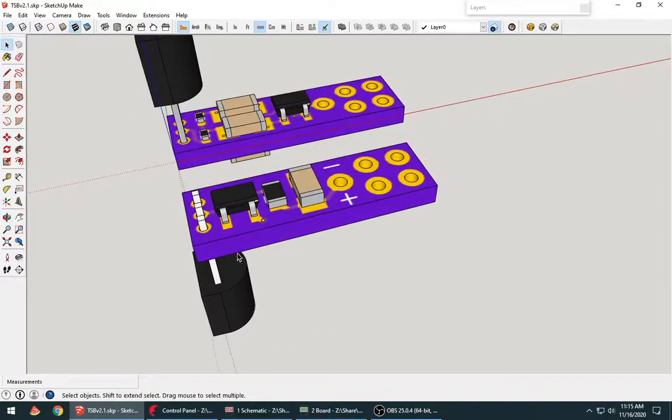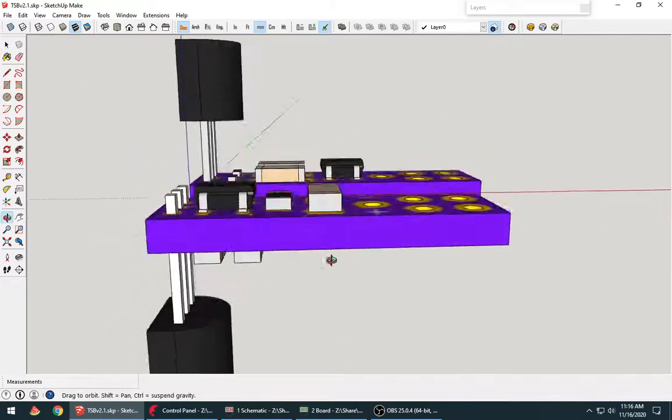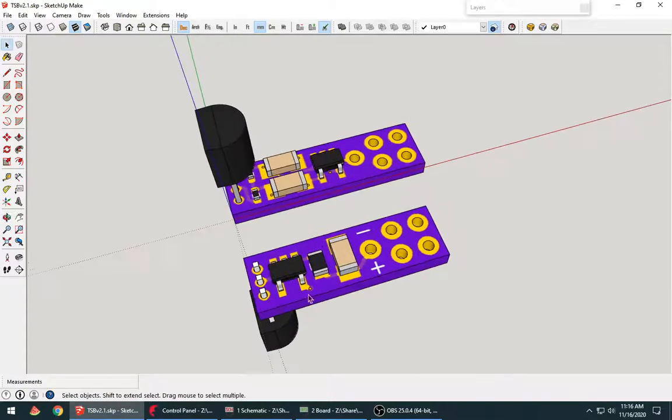And very simple buffer, and then just an RC low pass filter. So even if it still does some oscillating on the input and output temperature, well, output temperature, whatever it measures, this should take care of it. I think this will be the end of it. I can't believe I overlooked this thing. Anyway,